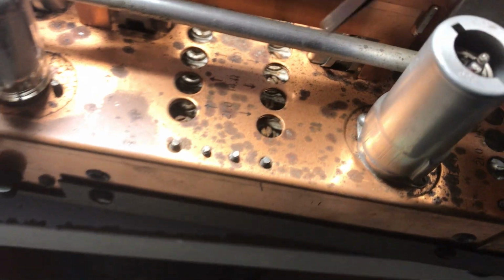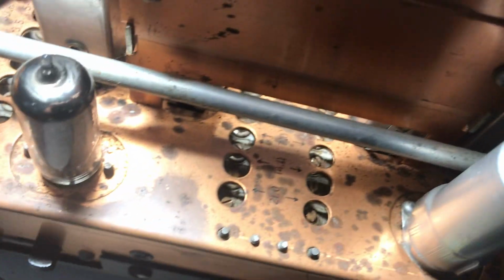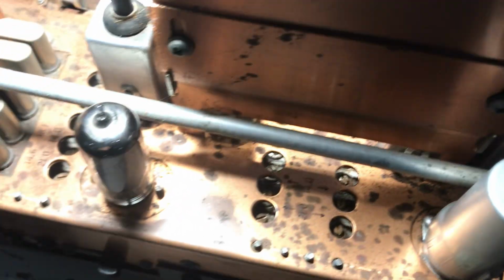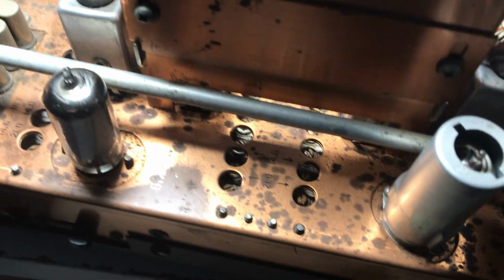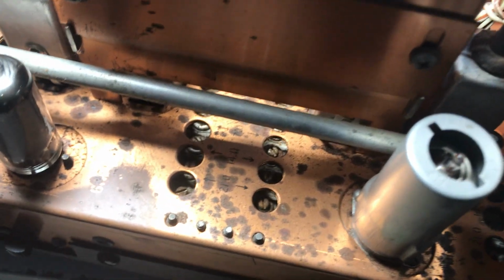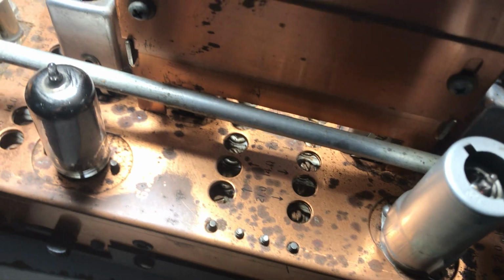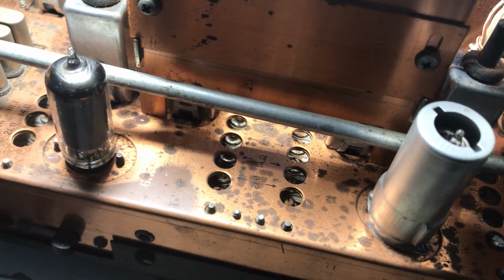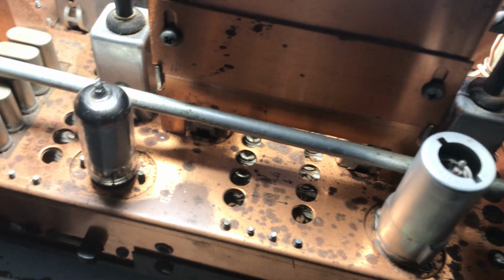Oh, and then once you're all done here, you want to go through and tune all these capacitors again and all the LC circuits. So you want to go through and just tune these all up again. I just put the radio on the middle of the band, so at 250 on either band. I'll just go to all the bands and go .250 on 10 meters. You want to pretty much go to the high side of the 28.5, because you might get a 29 crystal or something later. So I just tuned it that way, and it's reasonable now.